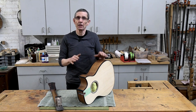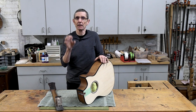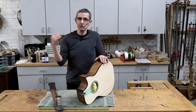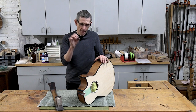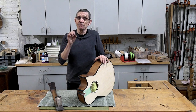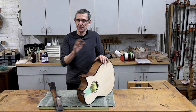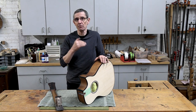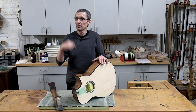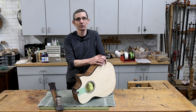I've also heard of people going up to only P1500, which is the way I used to do it, and then going to maybe like a medium or a coarse cut cleaner, then medium, and then fine, and then super fine, and so on. My system wet sands up to a pretty high grit because we want to make that whole system of buffing go as easy as possible. As I said previously, one of the scariest things for me, at least, is to hold a guitar body that's just about finished up next to a wheel that's spinning at about maybe 800 or 900 or 1,000 RPM.